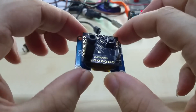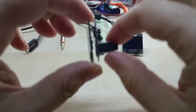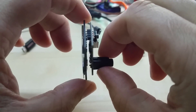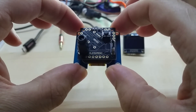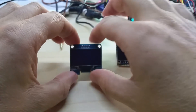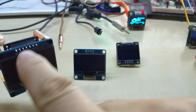Here is the PCB. It is all in SMD parts now. The special integrated circuit, the MSGEQ7, is now the SMD chip — the original, not those knockoffs from China. This is my OLED Maxi PCB, and it has a couple of features. I can have both displays, and I could even have the bigger 1.5 inch display with this PCB, with the SPI connection.